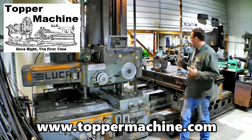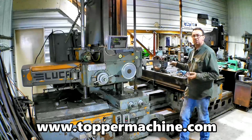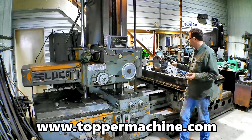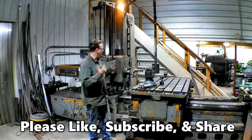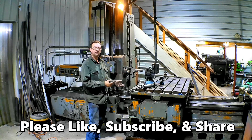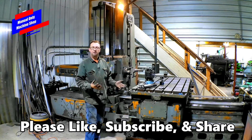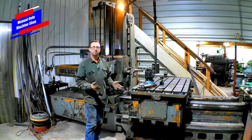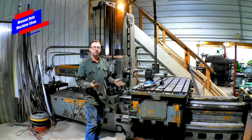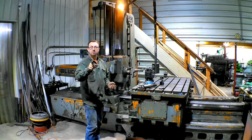There it is. In all total, we took 8 thousandths out of the inside diameter. This pump will have a long life ahead of it and can probably be bored out and rebuilt a few more times. Setup is the most time-consuming part of any job you're going to do on the boring mill, but they're a great machine — very versatile — and have a permanent place in the manual-only machine shop. So until next time, get out in your shop and get it done right the first time.